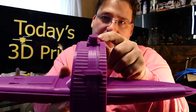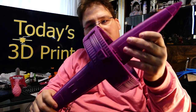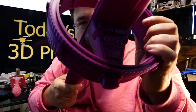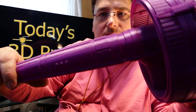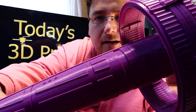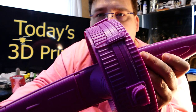I printed this in two parts. I noticed that this part here stuck out, so I lowered it through the print bed until it was sitting right on the print bed and printed that. Then I flipped it over and printed the other half, and I just glued the two halves together. Problem solved. The details are amazing — really nice. Look at some of the nice details on the model.